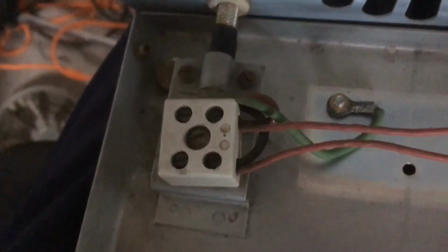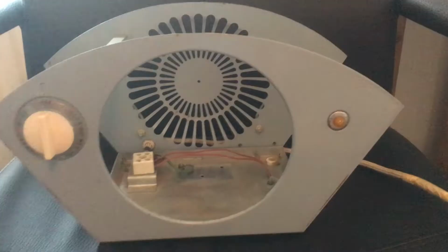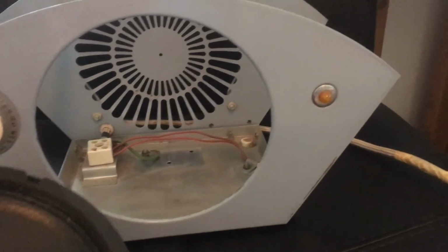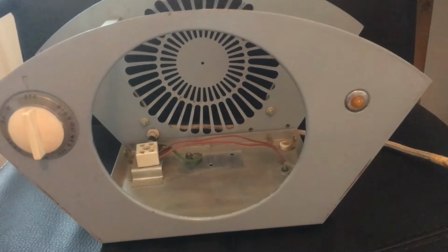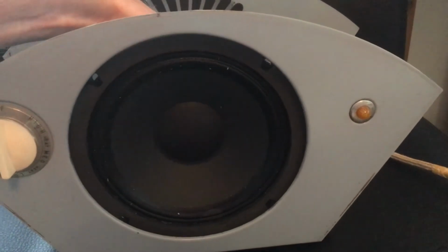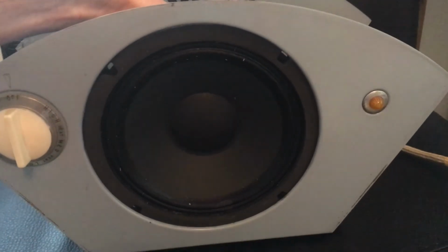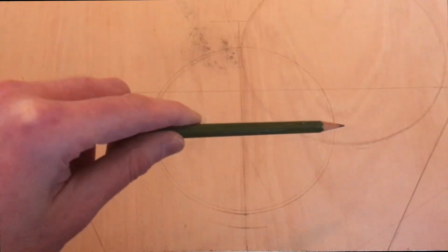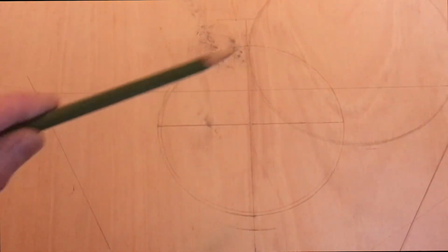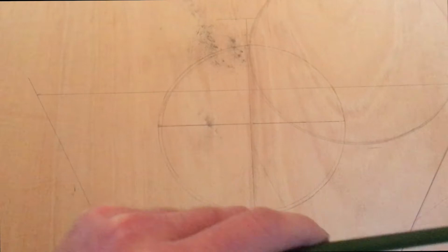I had previously eyed the measurements of the amp head and had planned to put the controls on the front. However, this is when I encountered the first snag. Well, two snags really. Firstly, having checked how the speaker fit the hole, I noticed that it was almost exactly the same size as the hole, so the screw holes had nothing to screw into. I realised that I would need to mount the speaker onto a piece of ply, so I made a template of the chassis with a smaller speaker hole. I used a 6mm ply.